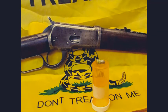Do it again. And of course, I just took regular .32-20 brass. I had to expand it a little bit more to bell out the case mouth so you don't tear the paper. Other than that, loaded it normally like I do. This was a light charge of 2400 powder. Loaded it, seated it just like you normally would, and then I shot it at 25 yards. And now look at the difference with that target. You'll see how much tighter of a group I got just doing that.